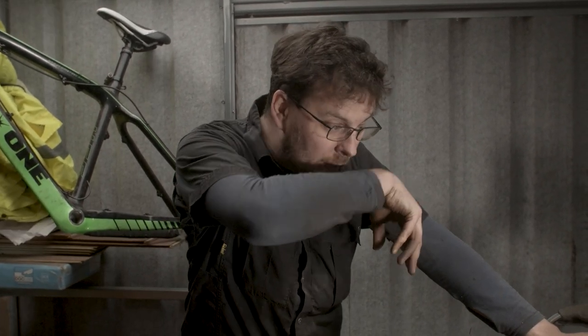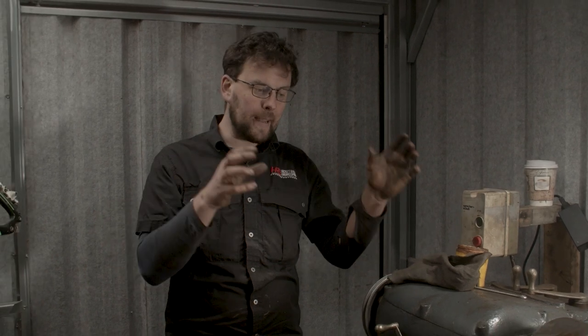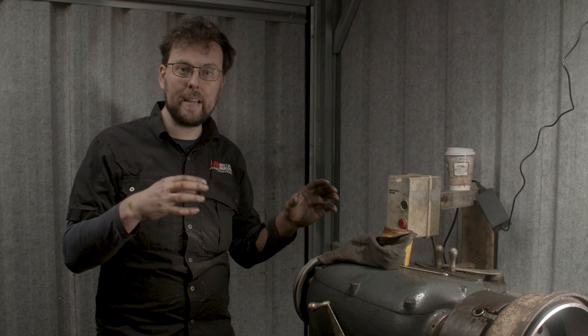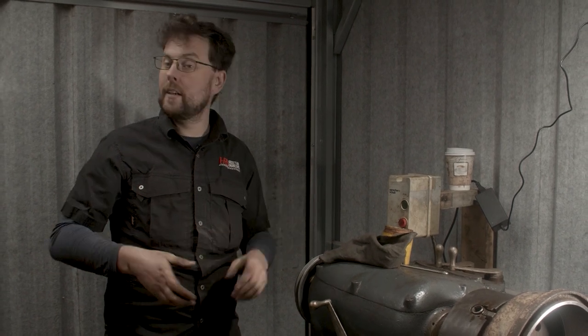Okay guys, I hope you enjoyed joining me here in the machine shop with the Colchester. As you can see, 90% of machining is like if you're going to paint something. It's all about setup. It's about getting the drum true. It's about getting all your cutters in the right place, getting your feeds and speeds right, and then the cutting operation itself is painless. You followed this real time as we cut that drum. Not sped up, not time lapse, just literally cutting that drum.